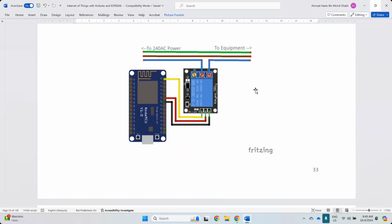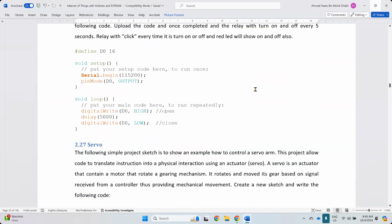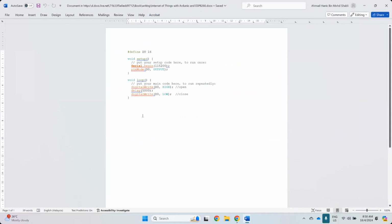All right. Okay, so very simple one. To do this, again, there's another code there, and this code basically just writes high and low. It will turn on and off your relay, high for 5 seconds and low for 5 seconds. Then it will keep looping and looping. You will hear the click sound all the time. So let's see if you can do that quickly. I forgot to upload the code to my Git, but I'm going to do it today. All right, so as simple as that,